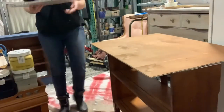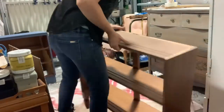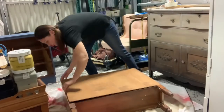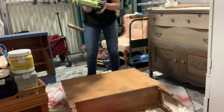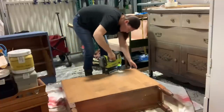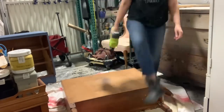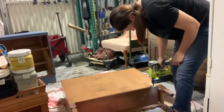Now those are all attached super snugly. I'm sticking this right side up and just making sure there are no wobbles. Since I cut down the cabinet, I didn't need that full sheet, so I just cut that down too — also with a jigsaw running along a straight edge. This fits right into the back very snugly. I didn't have to trim any of the wrapping paper because it was already flush with the back. Then I'm just taking my air nailer and putting little tiny brad nails into it, following the guides of the pencil lines so that it matched up with the shelves.